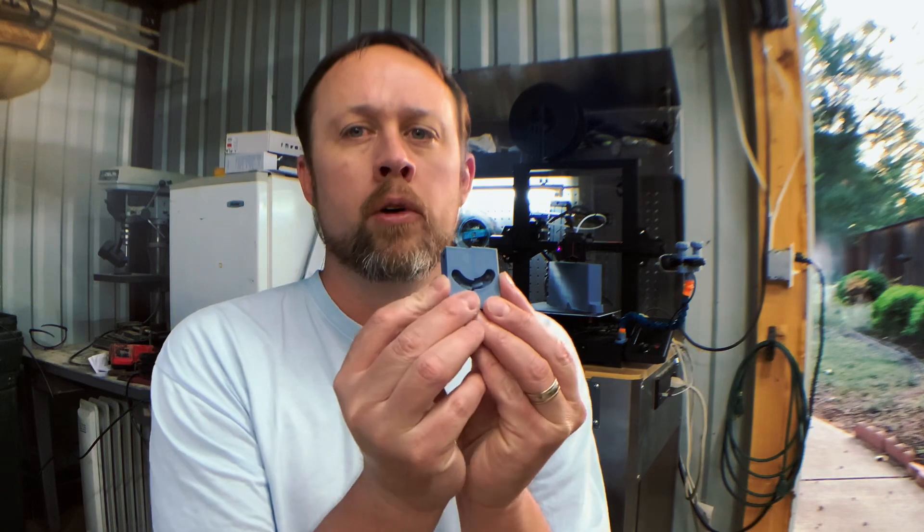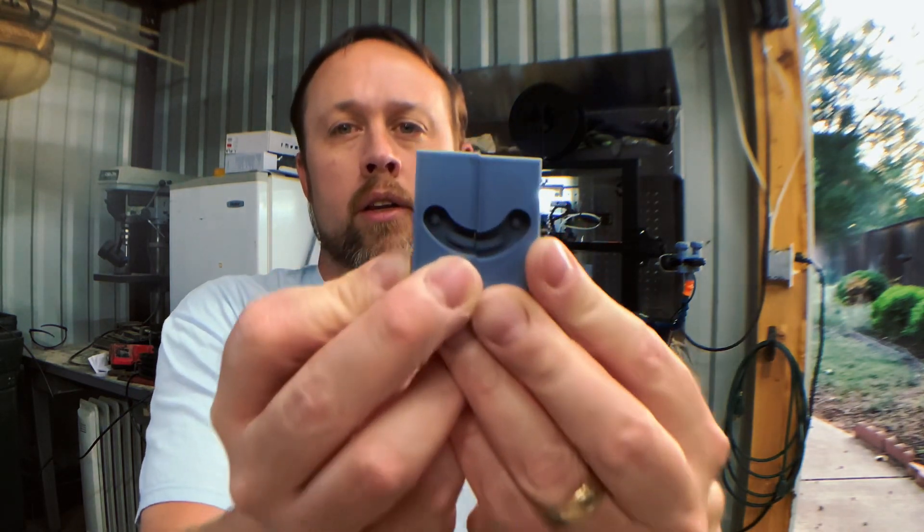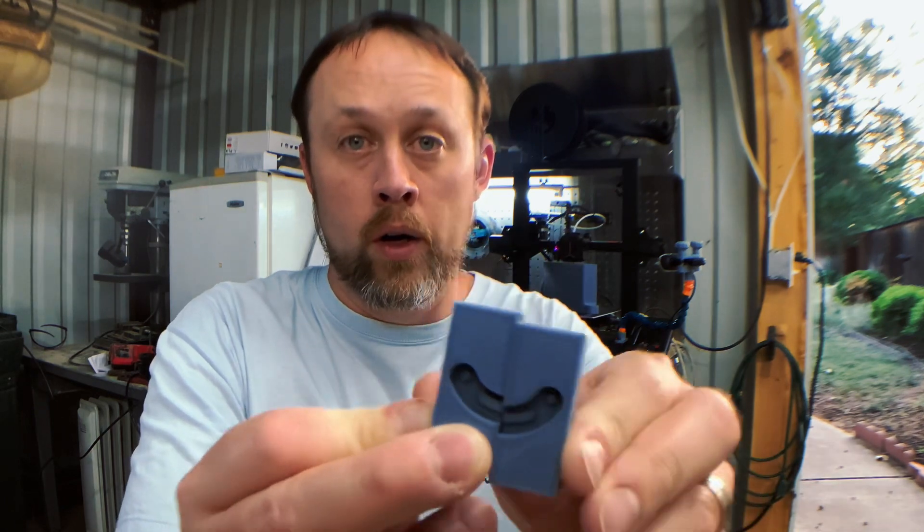It did actually make me consider doing a two-part mold to make it easier to release or break away, so we're going to give that a try too. I have a two-part mold here that comes together and has holes to align it. This will actually become the gasket for the switch for the pneumatic cylinder. You can see examples of it within the video, and this is derived exactly from the way LEGO does their switch. I've torn one apart — they have a gasket just like this, and I'm replicating it in a larger size.